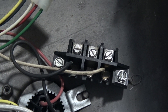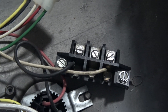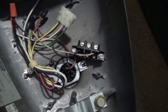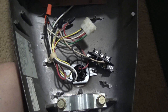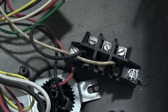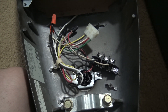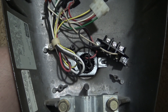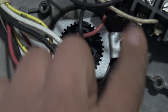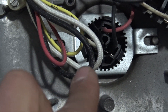This is a power door assembly style fixture, so none of the components are actually mounted in here. All that's really going on in here is just some wire stuff. That clip connects to your ballast, and all these wires basically just splice together and go down into your terminal block. Now this isn't the original terminal block — this fixture never came with its terminal block as it was stripped out. So I had to put a Thomas and Betts socket in, which luckily lines up with the existing screw tap heads. I went ahead and mounted that in the best way I could and connected some wires to those terminal blocks.